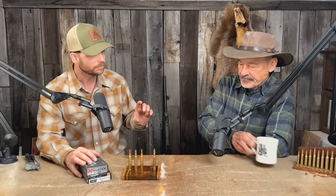Let's start a little bit back at the beginning and lead up to your experience with this rifle. Walk us through what Ackley did to improve a cartridge and about when he did that. You mentioned the 60s — is that when it all started? I don't know exactly when he started because he was getting these ideas for his improved cartridges by taking the taper out of the sidewalls as much as he could while still getting a decent release. You've got to have a little bit of taper to get a good easy release from the chamber after it expands. But then he would try to maximize within that footprint the powder volume.